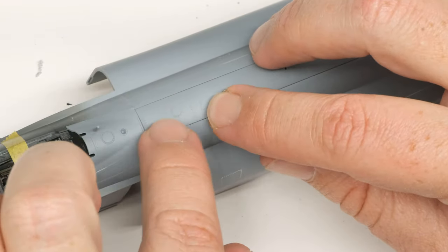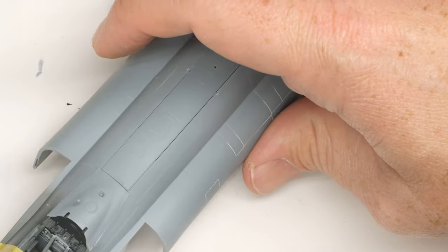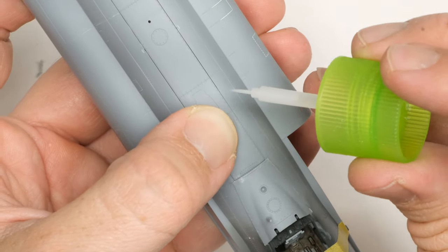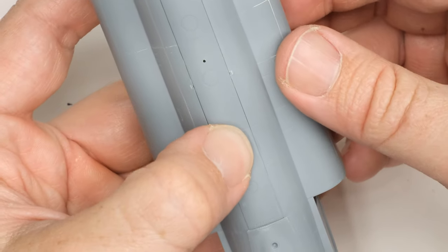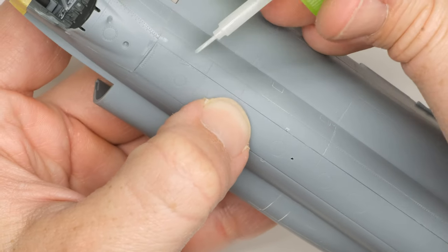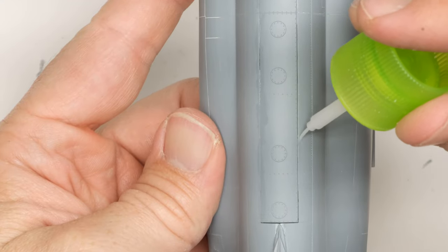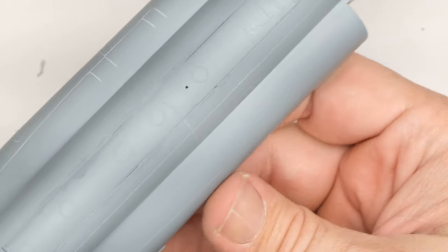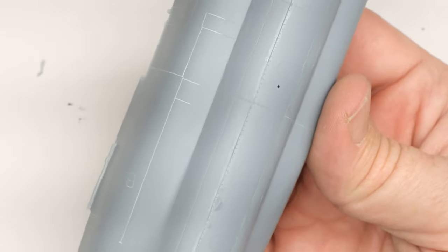I don't think we're actually going to need the toothpick — it's kind of the opposite. I just want to make sure that we've got overall a good joint happening here. I can already foresee there's going to be some light gap filling that needs to happen here. It's probably going to be a lot of masking tape and a decent amount of 3M red putty going on in this thing. Frustrating — it shouldn't have to be that way, but this is dicey engineering. Basically I'm just going to let this dry up for a little while, then come in and do some masking so that we can protect some of those rivets and get some putty going on in here. This isn't that big of a deal — it's just not the prettiest joint in the world necessarily.